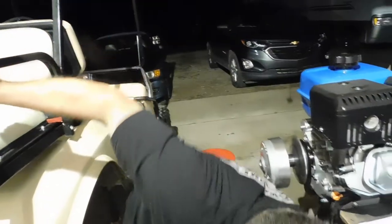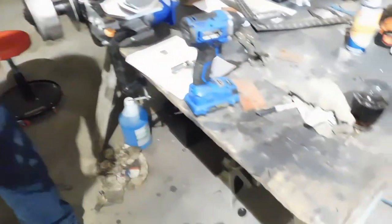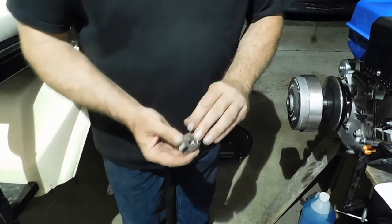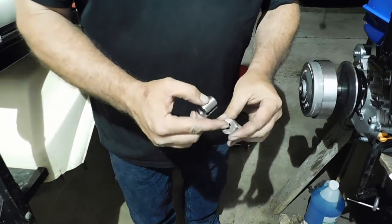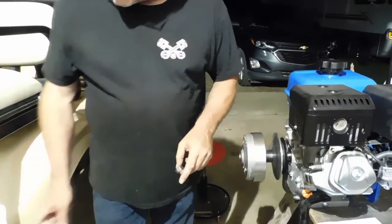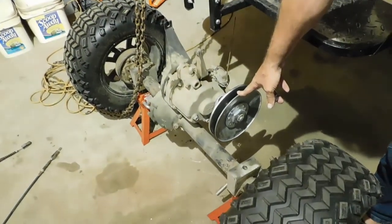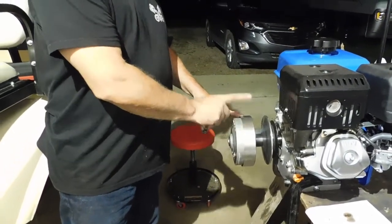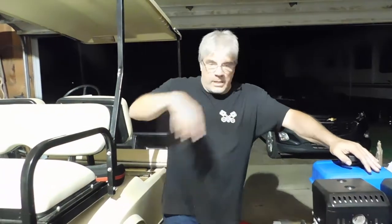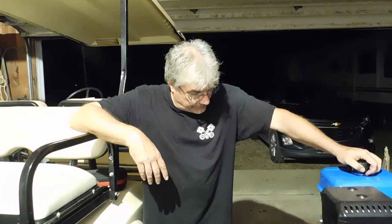The other option was to buy a clutch that would fit the shaft with a keyway, so you didn't have to cut it off twice. I had to cut it off twice — I cut it off here and then again. What I did was cut too far back, the threads didn't go all the way far enough. So when I went to tap it, there was nothing there to start. Getting that tap started straight — because that bolt's this long, it's got to be straight. It's a hundred and some odd dollars for another clutch, and I don't know if this part would even work with the other clutch. This was a pain in the butt and created a lot of swearing. Having to cut the shaft off on a new motor — that scared me a bit. I still taste it. That made me angry. But I did get it tapped straight.